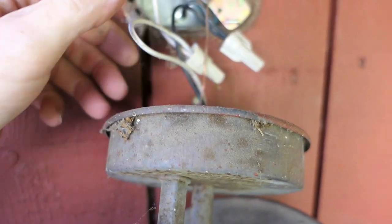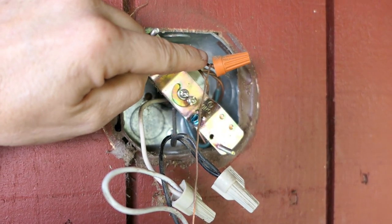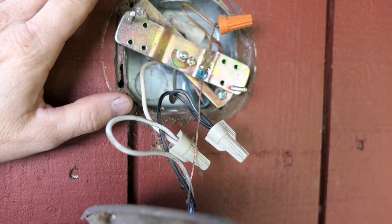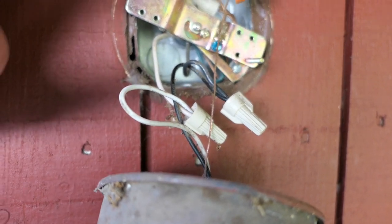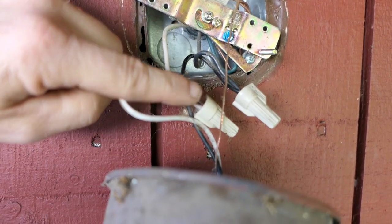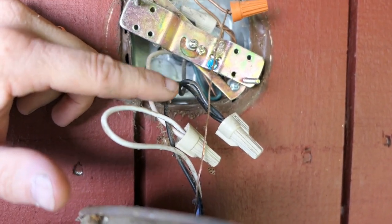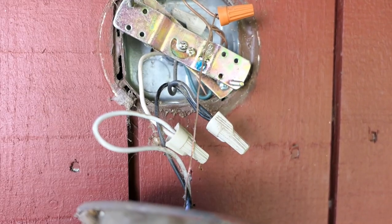Here's the light fixture. You're going to have a white wire, a black wire, and there should be a ground, although very often you don't see the ground — and that's all it is. This is a very typical setup. You want the light switch off at a minimum, or you can turn the power off at the breaker. The black one is the hot wire, so if you touch something with it while the power is on, you will short out. Best to have the power off. We're just going to unscrew these wire nuts and take the fixture off.